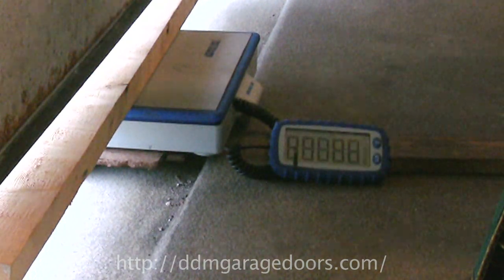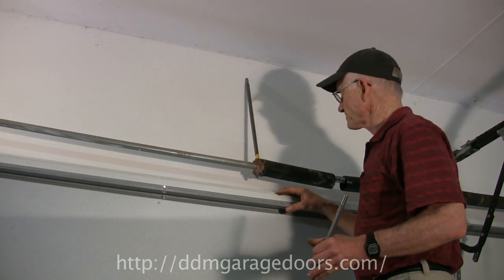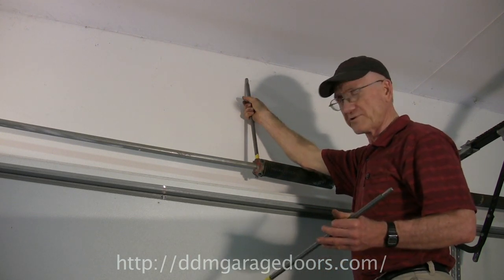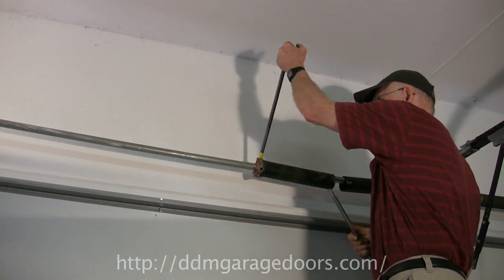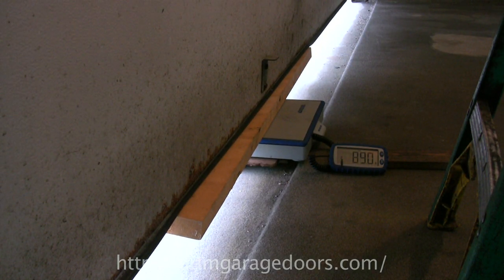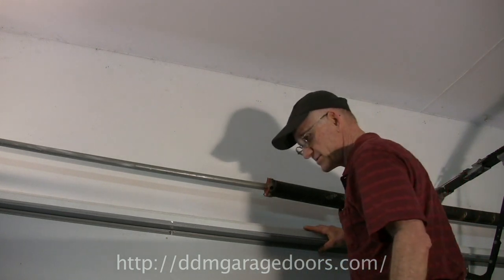To weigh the door, position the ladder in the center of the broken spring. In order to lower the door onto the scale, you'll notice the bar on top is keeping the shaft from turning. To lower the door, insert a second bar, pull down on the second bar, remove the top bar, and then allow the door to lower while restraining it with the bar. As it goes about 90 degrees, the weight of the door is on the scale. You'll notice it weighs about 111 to 112 pounds.